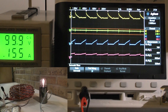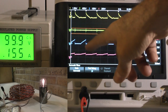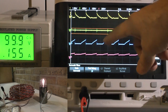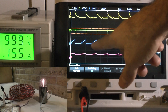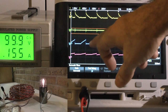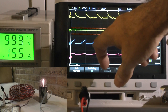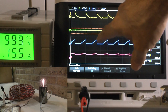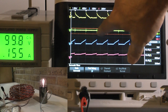There were sharp drops. So when the voltage goes up here, the current drops. At that same moment, that's quite interesting actually. We have a long gap where nothing happens. When here the voltage is 0, the current drops from top to bottom. When the voltage goes up here, there is no current, so it has no power at all here. At this small fraction, this little line, I have the highest voltage and the highest current, and also on the output side, that's this little green dot here.